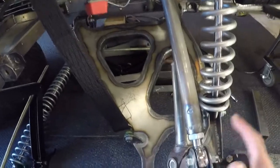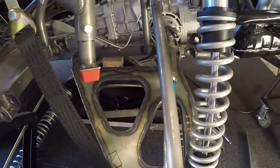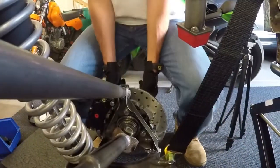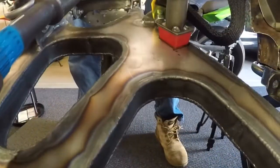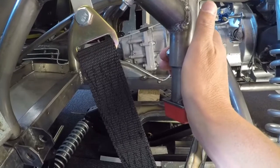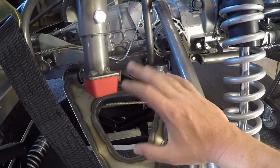I'm really happy with all of this. I haven't set the vehicle on it yet because I'm now in the process of fabricating all these parts for the other side. Over the next couple of weeks — it'll probably take me about three weeks — I'll be fabricating control arms, spindles, links, drive shafts, shock absorber mounts, limiting strap mounts, and bump strap mounts. Then I'll assemble all of this on the other side.